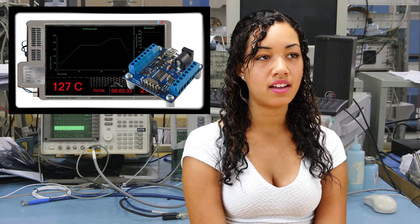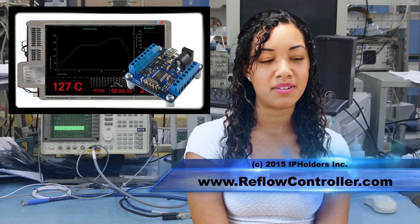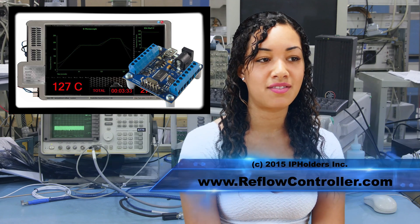On the final inspection, you can check for gaps in the epoxy seal and make sure the epoxy permeates two rows of the BGA. We have shown how the Tech FX Reflow Controller can cure epoxies, specifically Loctite 3609 chip bonder and post-curing BGAs for mobile high-stress applications. Stop by our website at www.reflowcontroller.com to get more information and visit our online store. Thank you.